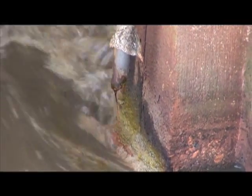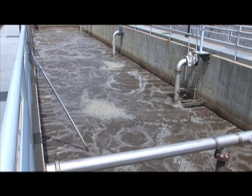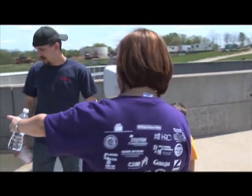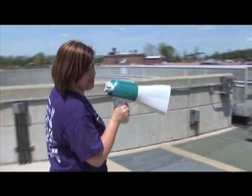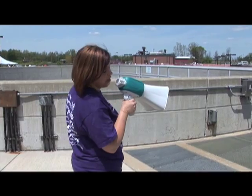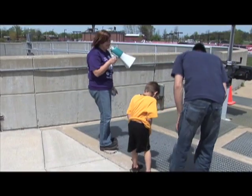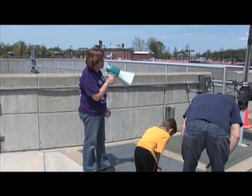When they come over here into these big tanks, they're called secondary clarifiers. We give them a rest, they sink to the bottom, and then we send them through to eat again. The bugs from over there are coming up and we're putting them in the tank over here, where they'll rest and settle to the bottom. You can see some bugs on the top, and then they sink. Look how clean the water is when it comes out — see how much the bugs eat?